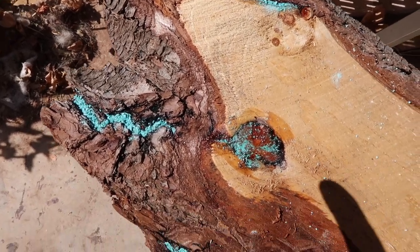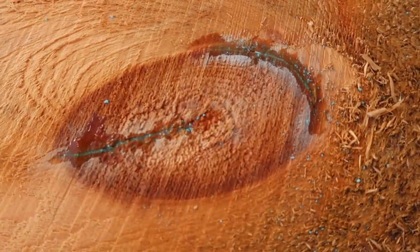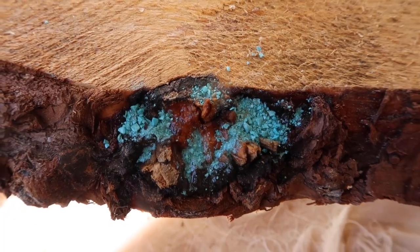This is what I've decided to do so far. I've got some inlayed in that bark. I did inlay the creases of each of these little knots included. Cool little knot there. I'm just going to let this dry and probably do a few more coats of CA glue in those deep ridges with turquoise to make sure that it's really in there. Before I sand it all down, I'm also going to put some thin CA glue along the edge where all of my bark attaches to my wood and probably within the bark as well. This was a suggestion from my friend Kai — thank you, I think it's going to turn out great.